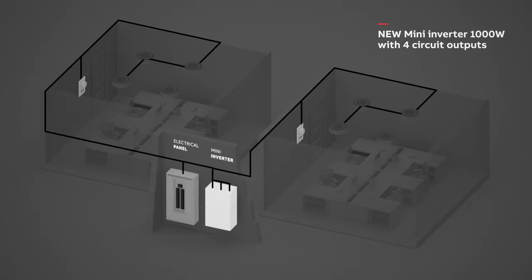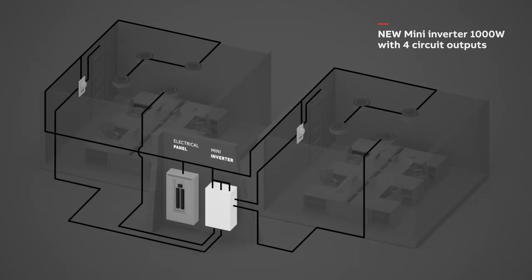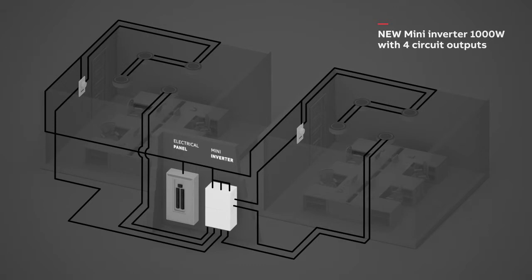Connect Mini Inverter input number 1 and number 2 to its unswitched input and the corresponding output to the lights that will be used as emergency lights in each zone. Wire each dimmer to one of the numbered LCO inputs of the Mini Inverter and the corresponding outputs connected to the light that will be used as emergency lighting in each zone.